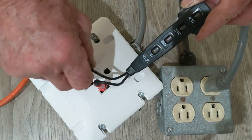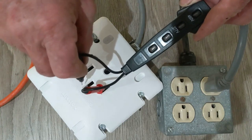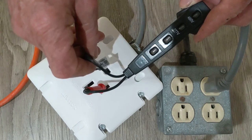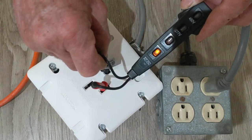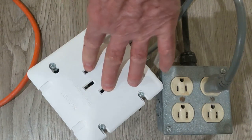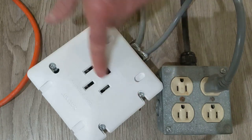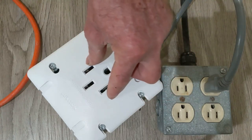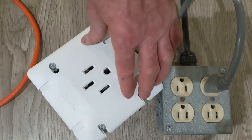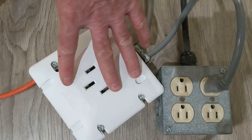And here I have 220 in this plug, as you can see — you can see it blink. 220 is right there. And then if I want 110, I just have this one — 110. So in this plug I have my 220, I have my 110, and this one would be the ground — the ground is connected too. That just takes a few minutes. You just have to find two hot legs and you have 220. Except in this case they are running 15 ampere, so you can have 220 but you cannot run something big — just something small that doesn't take that much power, 15 ampere. Like we run a construction heater and they work very good — a small heater, not big 220. Works good. We have it from a regular house, so plug this in and we have power.